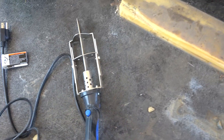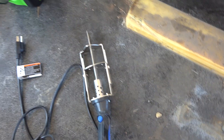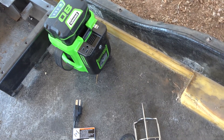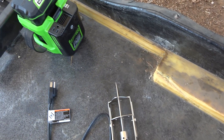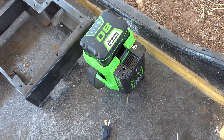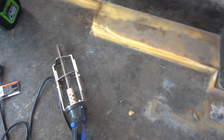This thing takes only 180 watts. I have a little Greenworks inverter that I'm going to test out — otherwise I'd have to run a long extension cord out here. This inverter can output 300 watts, and the hot knife is 180 watts. This battery is 288 watt-hours, so I should actually have a decent amount of runtime if it can power the heat tool.